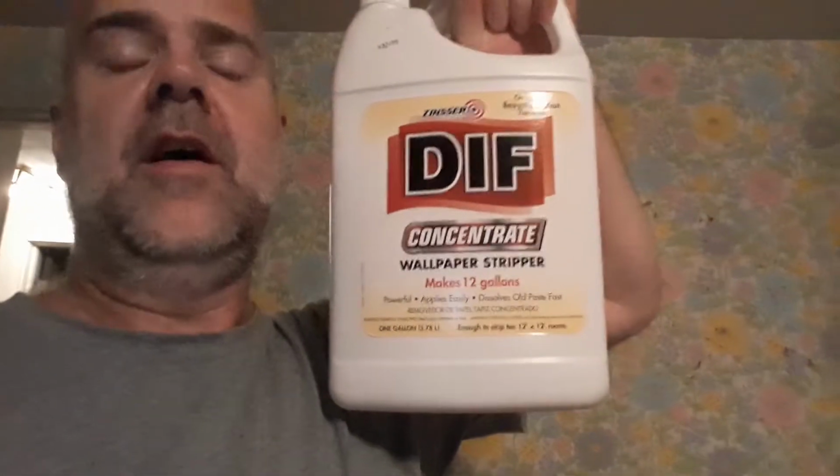So for the chemicals, look, I'm learning as I go here. So I went and I bought the cheap stuff. Didn't work. You know what works? Diff. Diff works. So it's a little expensive, but it works. Saves me a lot of time. So what I do is I put it in a sprayer. There's your typical sprayer. It's just a little tiny one. I fill it about a quarter way up with the chemical stripper, and I basically spray it on the wall. You let it sit 10-15 minutes or so, and you peel it off.